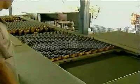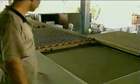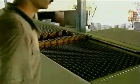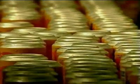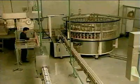At the filler, the pallets are unloaded and directed onto a depalletizer. With strapping and stretch wrap removed, the cans are taken off a layer at a time from the pallet onto the mass handling conveyor. The cans only receive a short water rinse before entering the filling machine, so cleanliness in the manufacturing plant is most important.